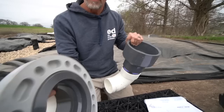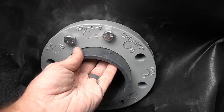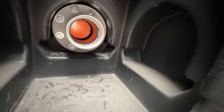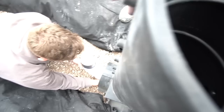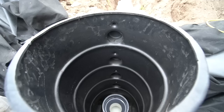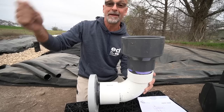The water then has to flow up to stabilize, then flows down into an entirely new wetland filter again — a funky setup. This big transition piece is the flange that bolts inside the snorkel. We cut the opening for this pipe so I can bolt the liner directly to the back of it, creating a watertight seal. We're continuing with our four-inch plumbing. Once it's installed inside, we'll never see it again. A big six-inch pipe comes up — not glued in place, dry-set — so whenever they want maintenance or to harvest fish, they just pop it out and all the water siphons out, leaving fish in shallow water to be scooped up.